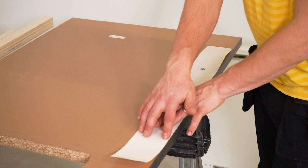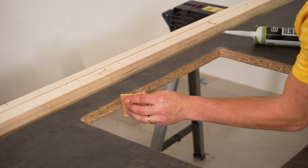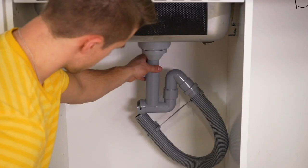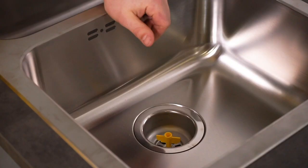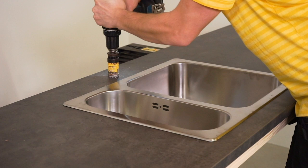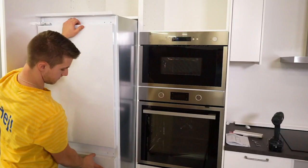Apply silicone on the edges. Place the clips and screws onto the sink, then put the sink into the worktop, fasten the screws, and put the worktop in place. Here's how to install the water trap according to the assembly instructions. The water supply can come from the floor or the wall. Depending on the sink you have selected, you might need to drill a hole in the worktop to install the tap — some sinks come with a pre-cut hole for this. It's easier for two people to install the tap: one to hold the tap and one to tighten it.